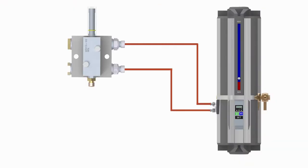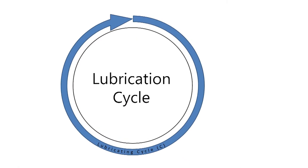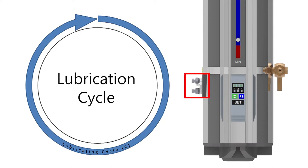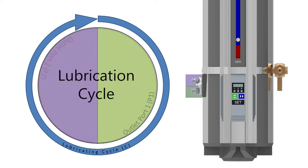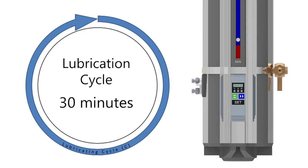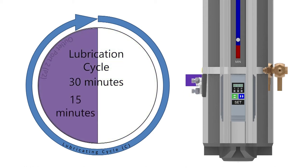The big job for the control unit is to pump the grease up to a high enough pressure to push the grease through the piping and stroke the doser. Since there are two control unit outlet ports, this process is repeated twice — once for port 1 and then again for port 2. The control unit monitors the pumping process in lubrication cycles, which is the time allocated for each of the outlet ports to be pressurized once. Therefore, half of each lubrication cycle is dedicated to each outlet port. For example, if the lubrication cycle is set to 30 minutes, then the control unit will be focused on outlet port 1 for 15 minutes and then outlet port 2 for 15 minutes.